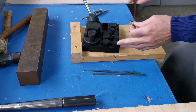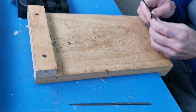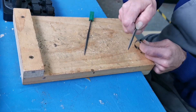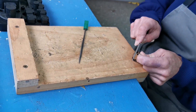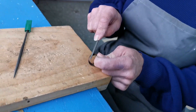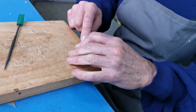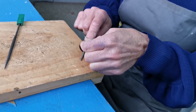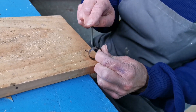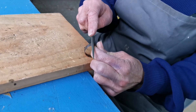I find these bench boards very good for filing. I've got a flat file and, separating them a little bit where the join is, I find a file that's triangular removes any of the shine where you're going to solder. Just removing that shine — there's a certain gloss on that metal from the manufacturing process — and that will make the solder spread through that joint really accurately.